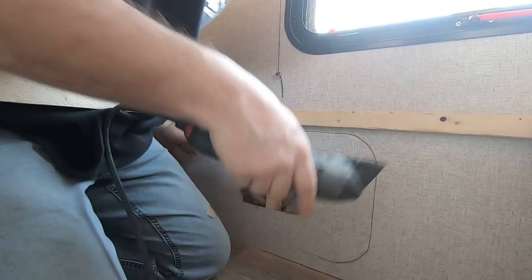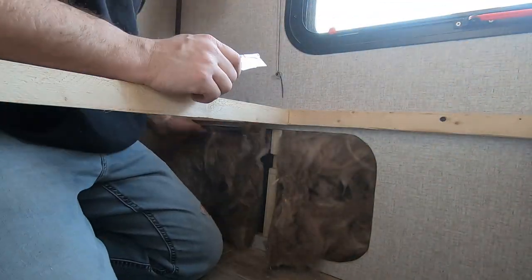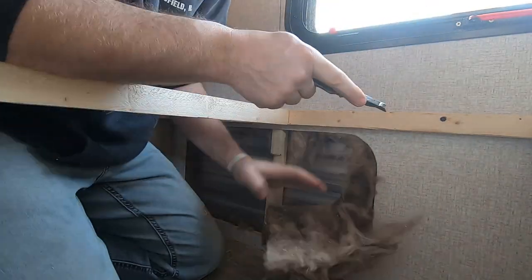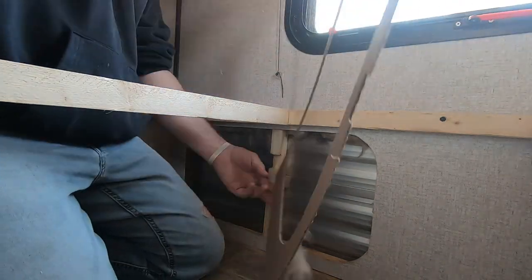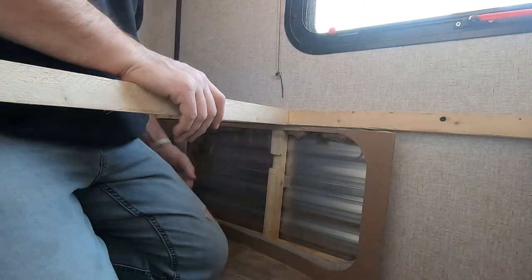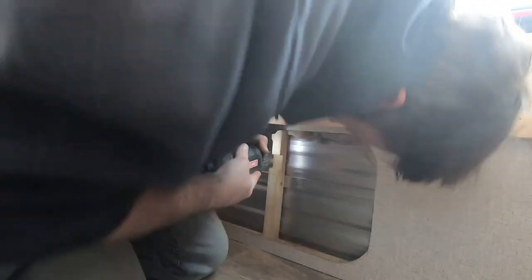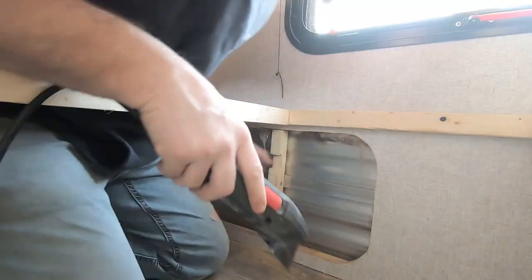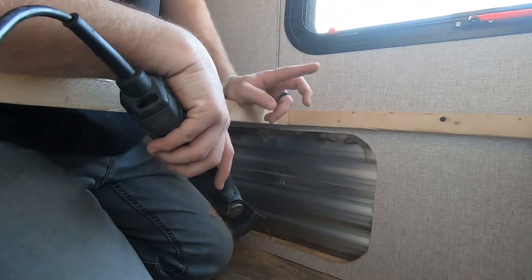Here I'm jumping to the next step — my final cut, and the piece comes out. There's some insulation in there; I used a razor blade to cut the insulation away, then held my template up to make sure I had enough cut out. I had to do just a little bit of trimming, and then I cut a piece of two-by-four out. Later in the video I'll add some more structure to the opening.